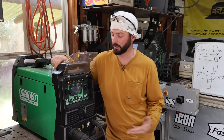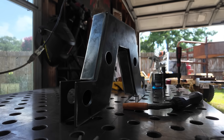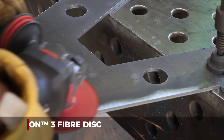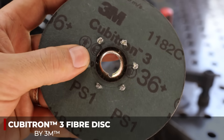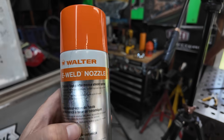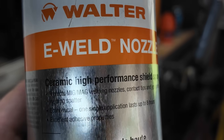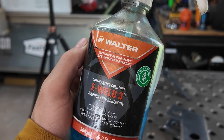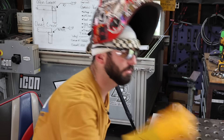We don't want a bunch of restarts — it just doesn't look as good — so that 4T trigger will help. Here we have our part that's ready to weld, all fit and tacked up. We did CNC plasma cut this, so we did need to clean up all the edges with the 3M fiber disc, the 36 grit plus. We want to have good anti-spatter on the nozzle, contact tip, part, and table. We want to have nice stacked ripples for people to see.